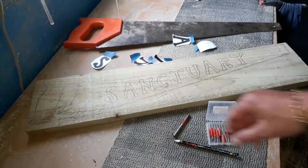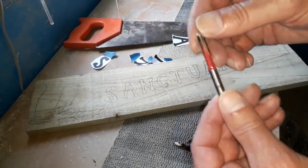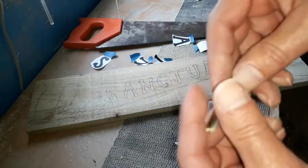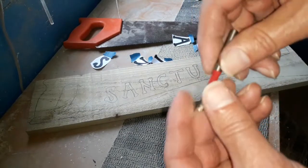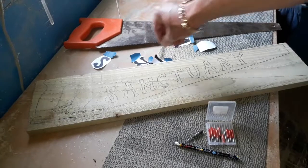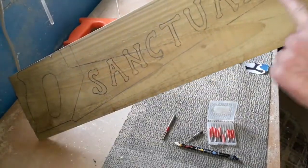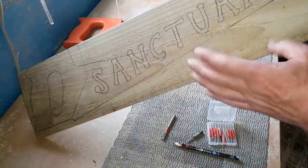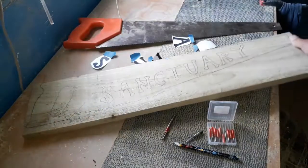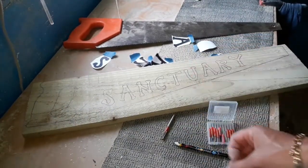Once that's all done, I'll replace it with one of these — imperial/metric double-sided blades. These come in bigger thicknesses. We'll throw that on and then we will remove all the outside. Before I remove the outside, we will cut around this with a scroll saw and then put this piece of wood back up again, just so the router has more of an area to work on. Let's set this up in the router and start cutting this one out.